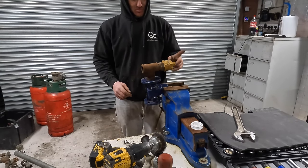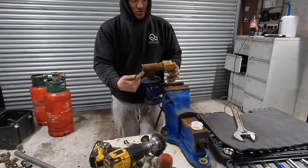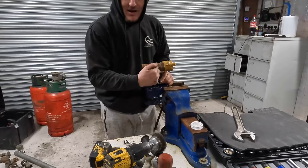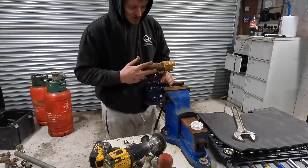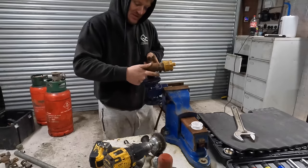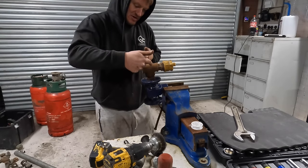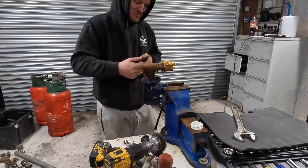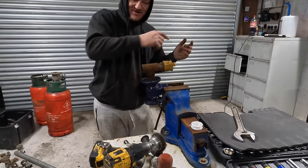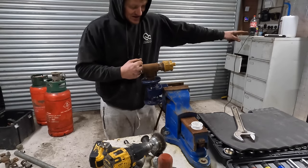That goes to my blast hose. That comes from my air in. Could do with one of those pieces that go like a Y shape. Not a Y that goes like that. They do them where it's a smooth angle, so media kind of drops into the line and is fired off that way, because air is going to be coming in this way and firing out that way.